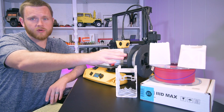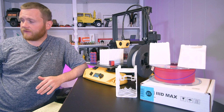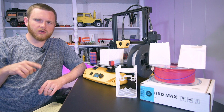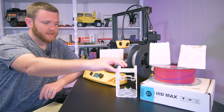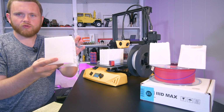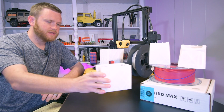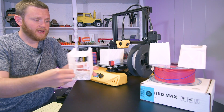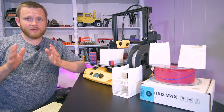It was over-extruding, and that's because I used the Aquila profiles that I have from the Voxelab machines, and in them they use 105% flow. Once I reduced it to 102, these things became super crisp, great prints with a shiny exterior, still plenty strong for what this needs to be. These are definitely complicated prints, and the machine prints fast. So that's the general overview from the experience.